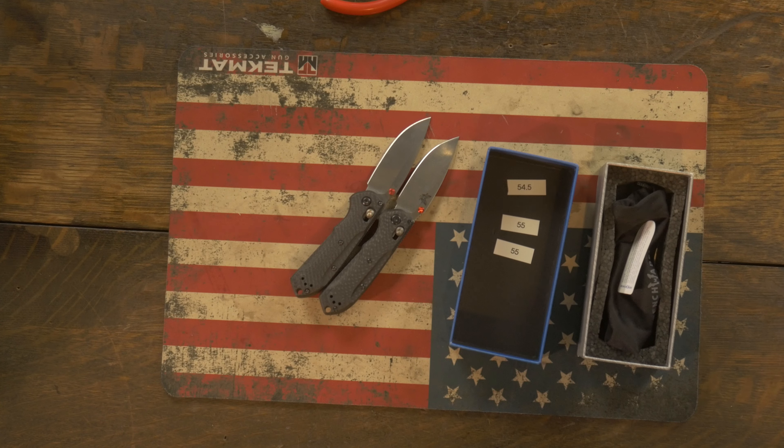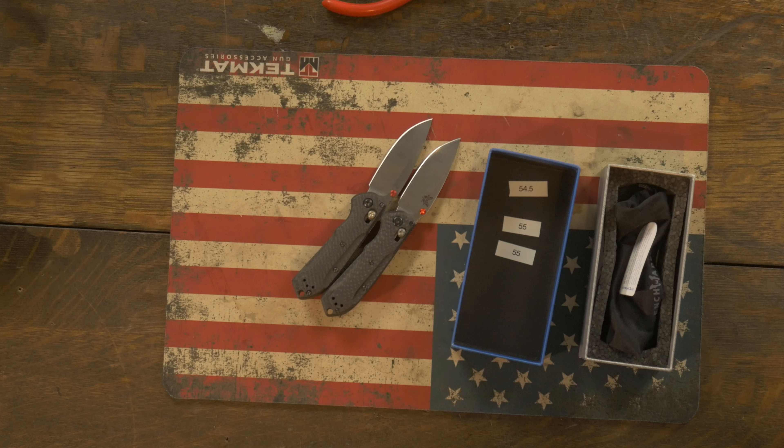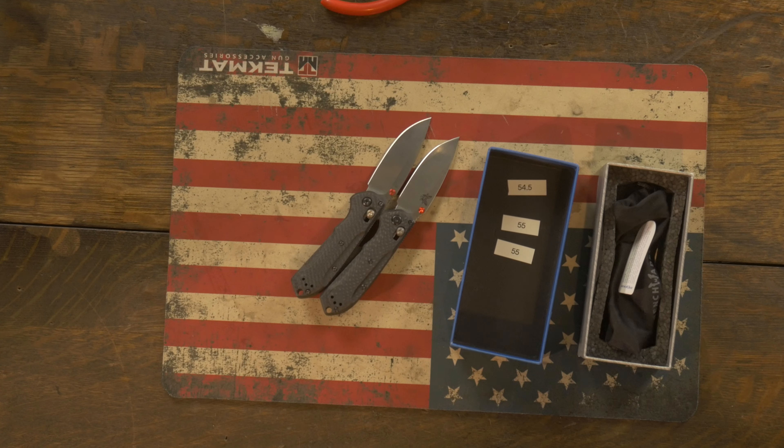Question of the hour: how do you tell the difference? In usability, you tell by Rockwell. And Chinese knives don't generally Rockwell very well. So let's see what the Rockwell numbers are. Counterfeit — go. That's better than I've seen in the past. 55, 54 and a half, almost 55. So it's a 440C knife — basically what those Rockwell numbers would be indicative of.